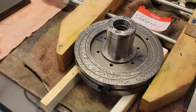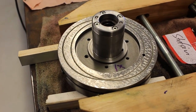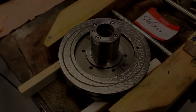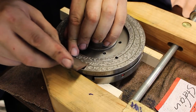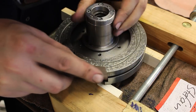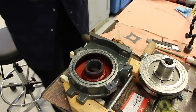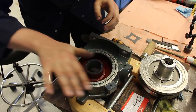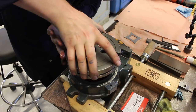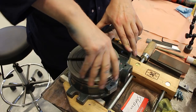I'm still working on the rotary table. Richard told me to very carefully deburr the eccentric oil grooves, otherwise they might scratch the sliding surface in the housing. Lubing up the rotary table and test fitting after I considered the bearing done. I was quite happy how the action of the rotary table was working out.